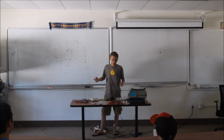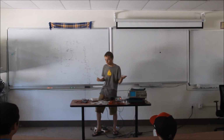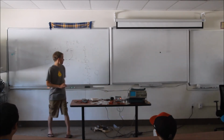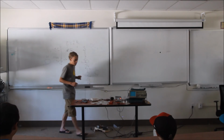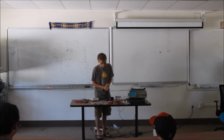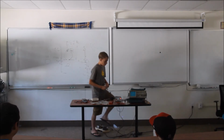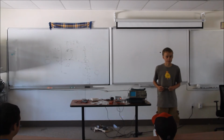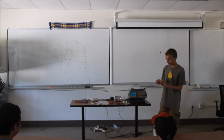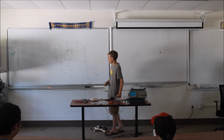So we have how many electrons are going through the circuit by how fast those electrons are going to go at a certain power. And we can see how much wattage is flowing through a circuit if we just measure the current and measure the voltage. Now if we take a small resistor like this one and we hook it straight up to the power supply, we can see how much wattage is being lost. Because let's take a 220 ohm resistor, for example, and we're going to run it off a 12 volt power supply.